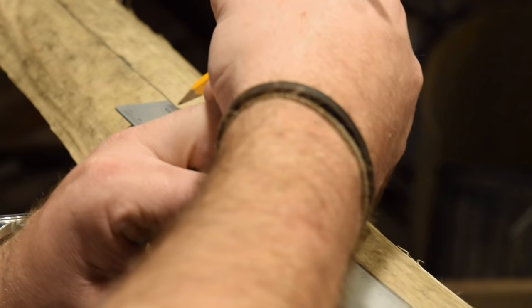Now obviously at this point everything is really high draw weight and it's not a ton of bending, but I wanted to see what was working, and right now it looks like both of the first quarters of both limbs, the top and bottom, right outside the handle are bending. Everything else is staying pretty straight, so I'm going to work on taking material off of everything on both sides, but focus on the outer 2/3 of both limbs.